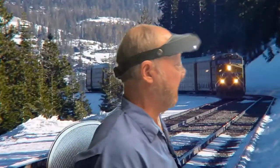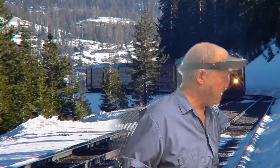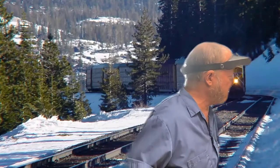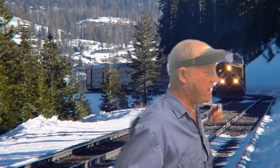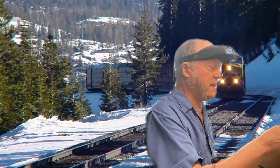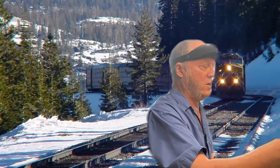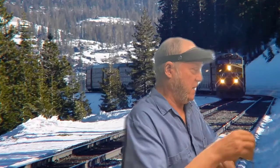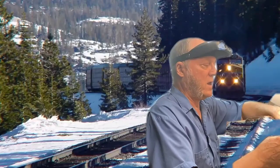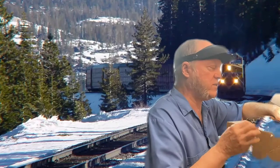Well, unfortunately, LEDs have a thing that they do that makes it a problem. The LED's internal resistance, if you will, can vary as they move through their operating range, and they're not identical units. So if we had one purple wire going to both LEDs, and just had the purple wire, LEDs are active devices. Those are semiconductor devices. They're not like a resistor.